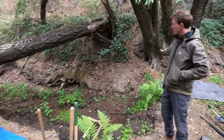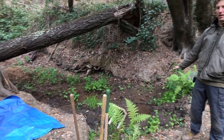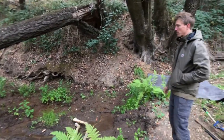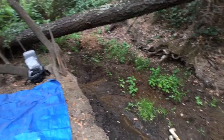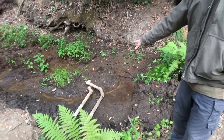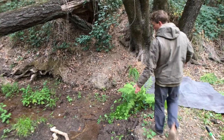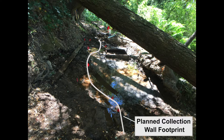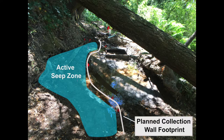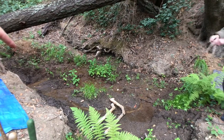This is the broader seep zone behind me here, so you can see there's a fully hydrated edge and there was a lot of standing water in this lower zone. It's been dug out a little bit so it would drain more effectively and to make it easier for us to work in here. Right here in front of us is where the old spring box was, where these two pipes end. We're going to be putting in a new collection system — one contiguous collection wall starting from about where I'm standing, arching up into the hill and back on the other side, with two separate collection points. They'll both be coming into the existing piping right here in the middle.